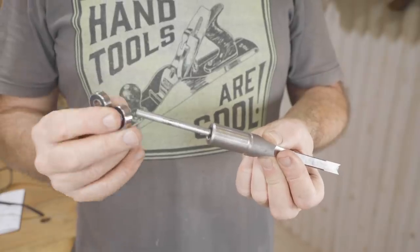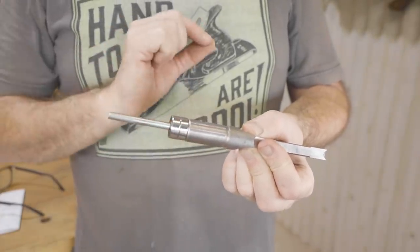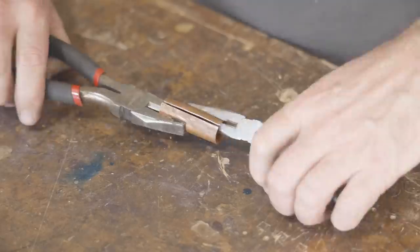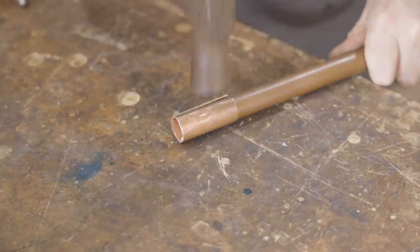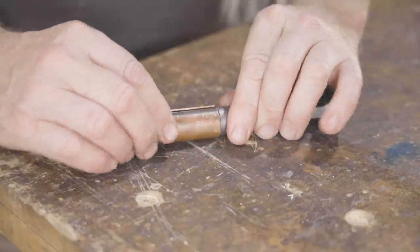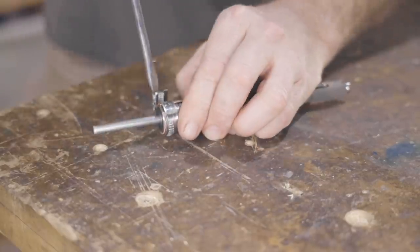You need a couple of bearings that fit well onto the drill bit, and the outside diameter needs to be the same as the shank on the chisel. One of these mortising bits only costs around $12 off eBay, and a couple of bearings cost a few dollars — you could even manage with one. With a collar made from whatever you have lying around and a couple of hose clamps, it takes five minutes to put together. So if you haven't got a mortising machine, this is an easy and cheap option to make these joints.